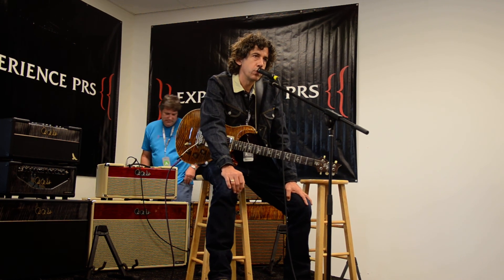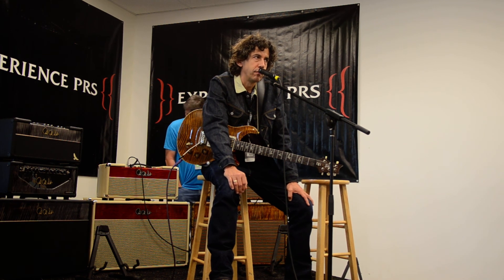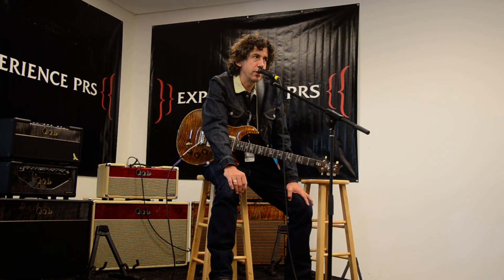When we got this version going, we had some really interesting adventures. I was pushing Doug — let's get the plate voltage happening, let's make this thing sweat. He did it, and I had a couple instances where the power tubes actually broke off in a perfect circle. The caps broke off where the tube retainers went around them because they were so hot. Needless to say, we toned the heat down, a little bit of the voltage, and put two fans in the back of all of them. But it's great to have that stuff happen in the design process and not after they're already out there.